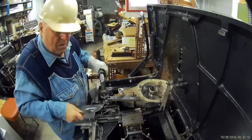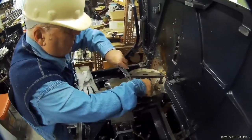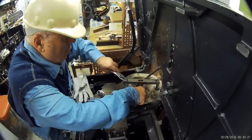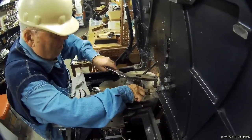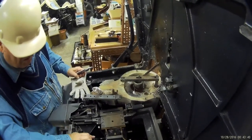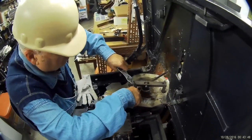I'm going to try to rip this up, bring this over, and put it on here. You've got to get it quite... There. Did you see it rise up? It did — why? Because that's how clean the hole is, and steel will float. Steel will float in lead. Right. You push it down — not too hard — and be careful.